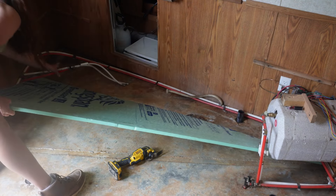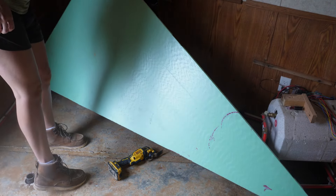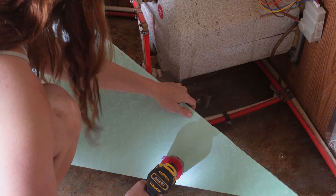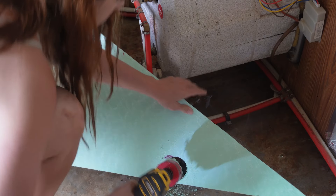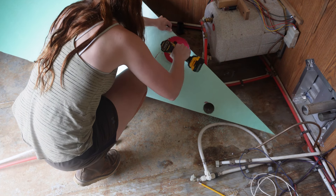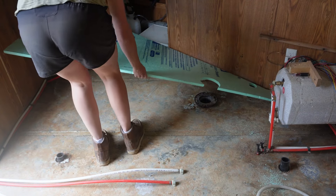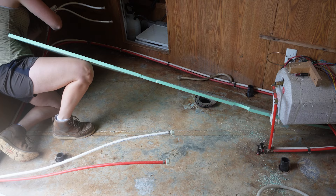I did the plumbing vent first because it sticks up out of the floor, making it easier to mark. For the toilet flange, I used a hole saw, making it slightly bigger just in case I'm a little off. After cutting the first hole I pressed the sheet down again for the second mark. I used another hole saw — not exactly the right size since I didn't have one that big — and then finished cutting with a razor blade to get it close enough.